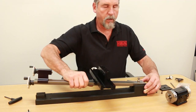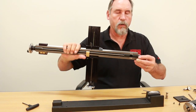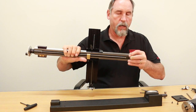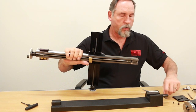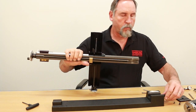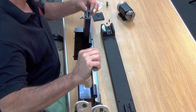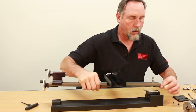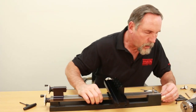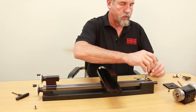If I take the entire base off right now, you'll notice that it's got a cutout on the lead screw support. What I'm going to do is pull out the lead screw support, take the pivot pin out of here, and put the new pivot pin in. Then put the lead screw support back in with the cutout facing down — it's all the way in. I put it back on the base so I have a nice surface to mount it onto, and I line up the threaded hole for the countersunk hole for this screw.